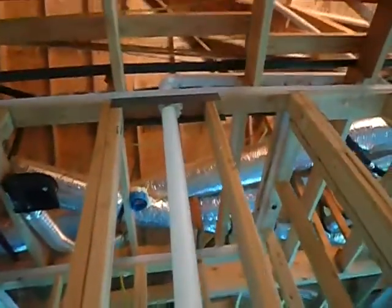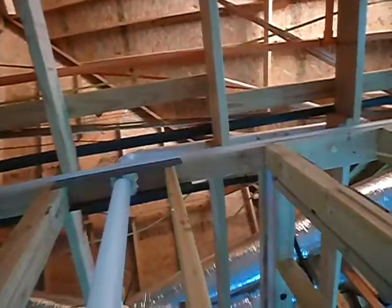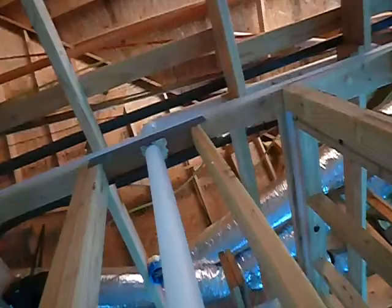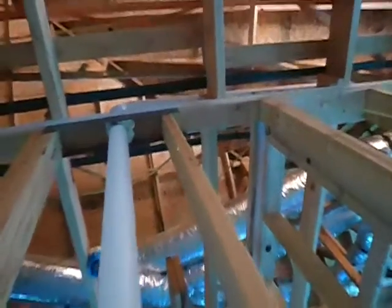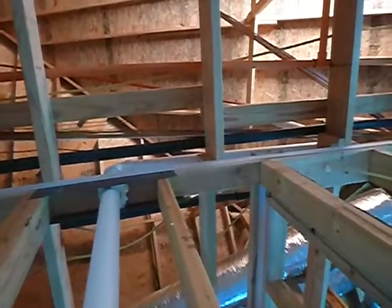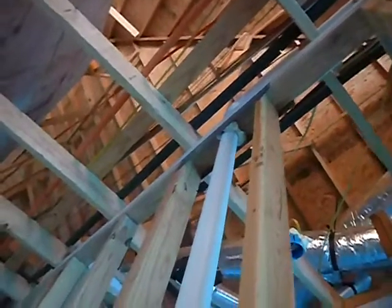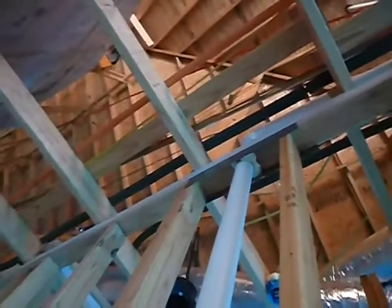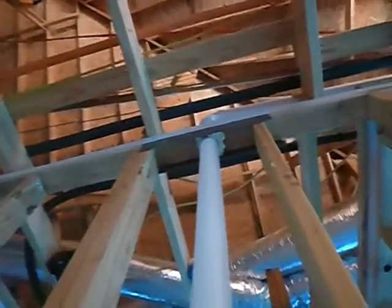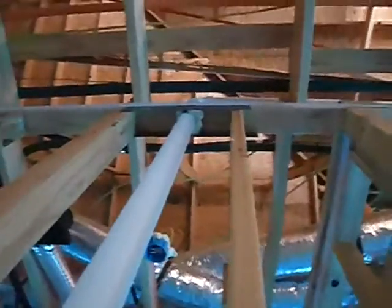This is a great example. When I was talking in the laundry I was talking about the fire suppression system and the holes they put in the wood. Look at this one right here — those are nailing plates. I was hoping that was a saddle because that is more than 50 percent. It is more than 50 percent. With the nailing plates I think you're structurally okay there — but that is a judgment call.